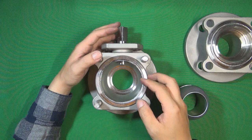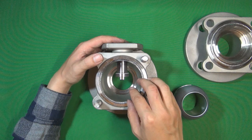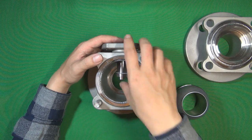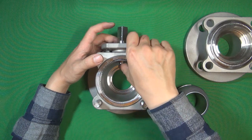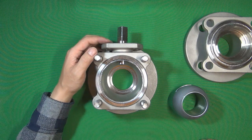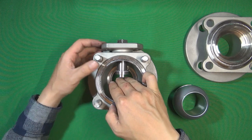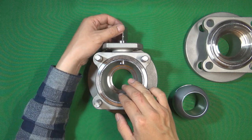Next I'm going to take out the valve stem to see what it looks like. A ball valve stem is assembled from inside the valve body cavity. Because the cavity has pressure, if we mounted the stem from outside and the cavity had pressure, the pressure could push the stem flying out of the valve body — a very dangerous situation. So we mount the valve stem from the inside of the valve body, ensuring that cavity pressure cannot push the stem out.